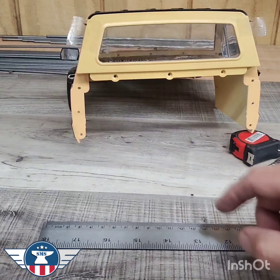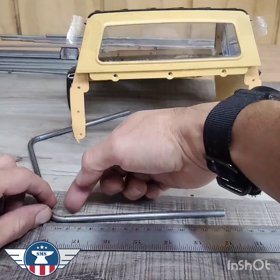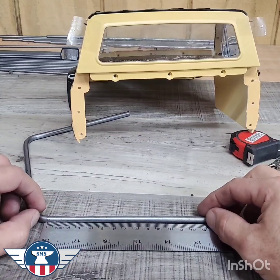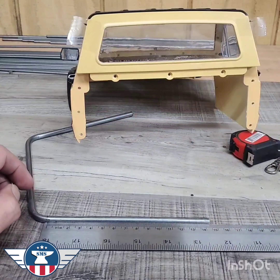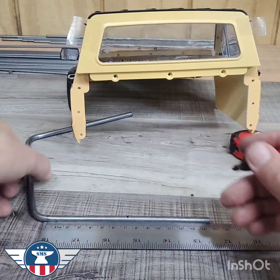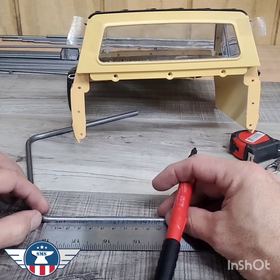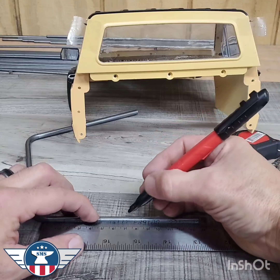The big reason I like these metal rulers is that it makes stuff like this super easy. You can just lay your part down, set your original mark at zero, and then send our new bend line at 70. And just do the same thing with the other side. Doing it like this keeps it very simple and harder to mess up.